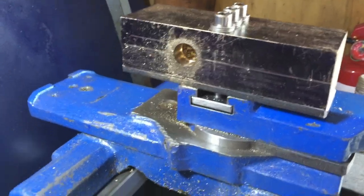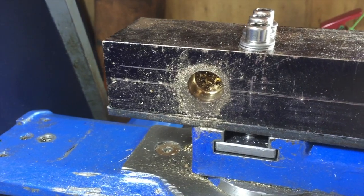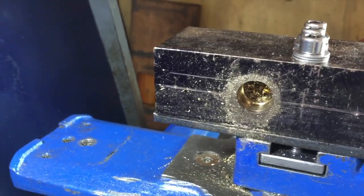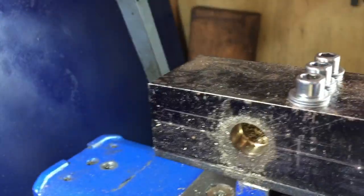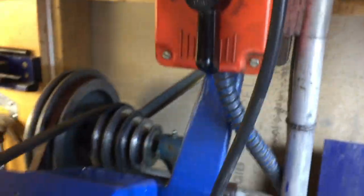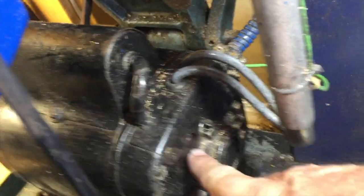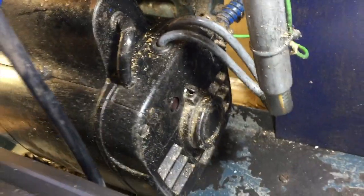I had my piece of brass all polished up and was drilling the first bore hole. I went through a series of drills — 6, 8, 10, 14 — and was finally drilling a 17mm hole. The next step would be to use a boring tool, but the tool jammed, the motor suddenly stopped turning, and now my motor doesn't go at all. I think I burned it out. It does have a thermal cutout switch on the end, supposed to trip out if it overheats, but I guess it doesn't trip if it just gets too much current through it.